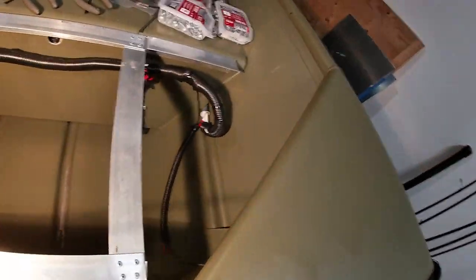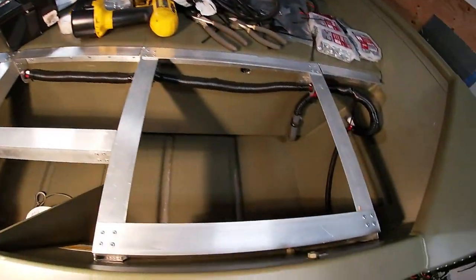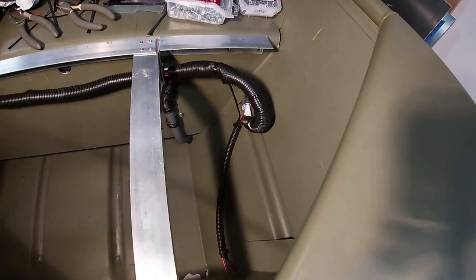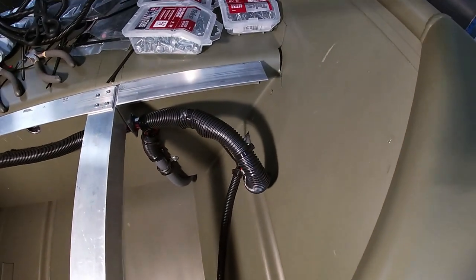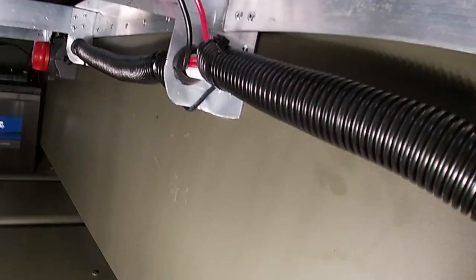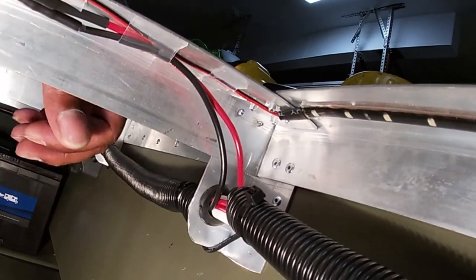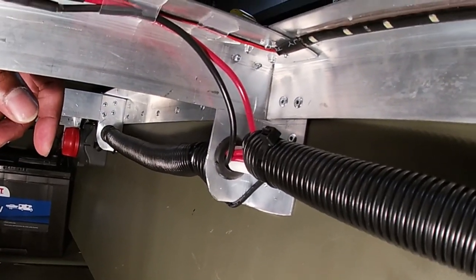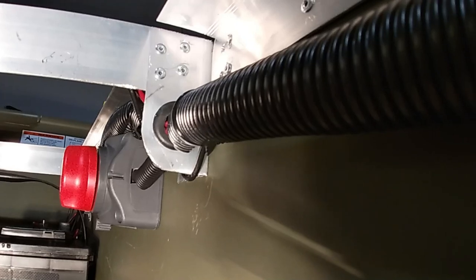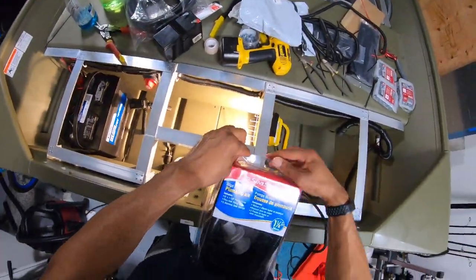We are done with the back of the boat — the bilge pump is in, everything is wired up, wires are secured, and everything has power. Using wire looms and wire ties I was able to clean this up nicely — everything looks very clean and neat. I also want to give a shoutout to Sean, one of our subs, who suggested shaving off the sharp edges on the hatch supports so I don't cut myself reaching in. Great idea, Sean — probably saving me a trip to the emergency room. Last but not least, I need to get the hose hooked up — almost forgot about that.